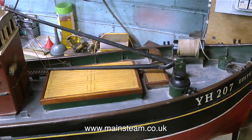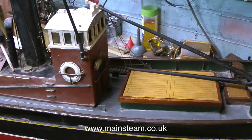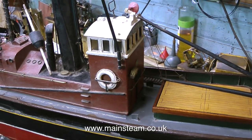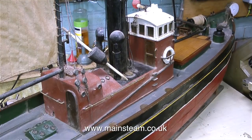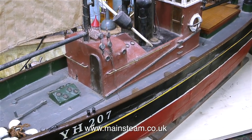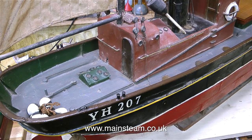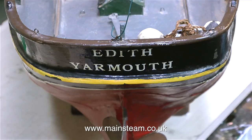So what conclusion do I come to with this boat? It's old, and it's not quite as neat as the first one I worked on. But in my opinion, the model really captures the essence of an old steam-powered fishing boat. The boat has some structural issues which can all be put right using modern materials. The ballasting is a problem — there's an enormous amount of ballast inside which puts a lot of strain on the hull. What I propose is to create a water tank in the entire bow area of the boat, and that would be the ballast. The water can then be pumped via the engine's water pump into the boiler, allowing for much longer sailing times on the water. Thanks for watching, and I hope you found it useful.